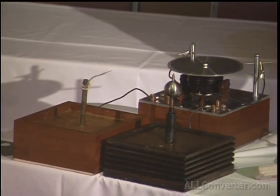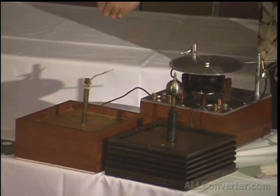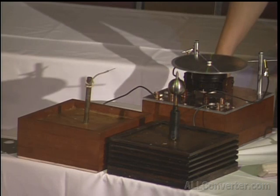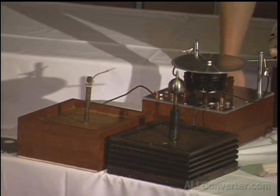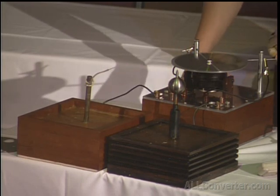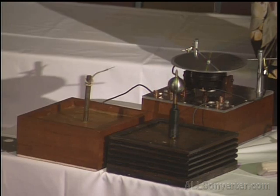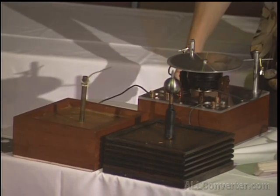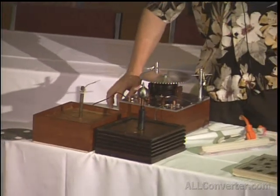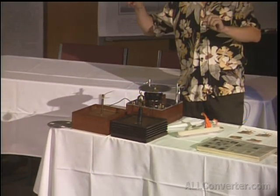And the coils here, they're of the flat spiral variety. I have them side by side just because I've made a lot of these coils, and the ozone permeates the air. It's basically a flat spiral of wire, and there's a certain number of turns in each layer of wire in this system. It starts off with about 4 towards the center and increases to around 32 on the outside.